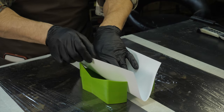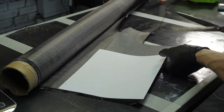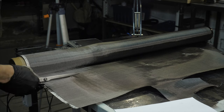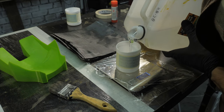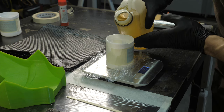Using a paper template and the form, determine the dimensions of the carbon sheets and cut the required amount with a margin of a couple of centimeters on each side. You can mark the fabric across the roll with a white marker. Long lines along the roll are more convenient and accurate to do by pulling out one thread of fiber and then cutting along that line, which exactly coincides with the weaving lines. Weigh all sheets of fabric and then mix epoxy resin and hardener of the same weight — one kilogram of epoxy per kilogram of cloth is the general rule for most composite parts.